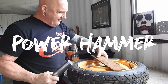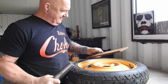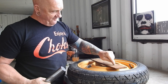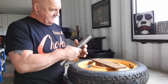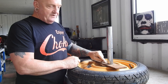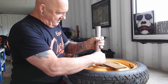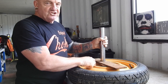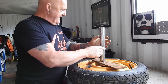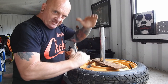What we're going to do now is our offset. I've got a piece of flat bar, again it's probably 10mm thick, pretty hefty. I've marked the centre, I'll have to cut off round here and round there, I'll weld it onto this section of the rim. This will be the offset shaft, which is 2 inches off centre. So as that goes round on the wheel, we end up having a 4-inch throw of this distance when it's connected to the hammer, but with the flexibility of the hinge of the hammer, it'll actually go further than that.